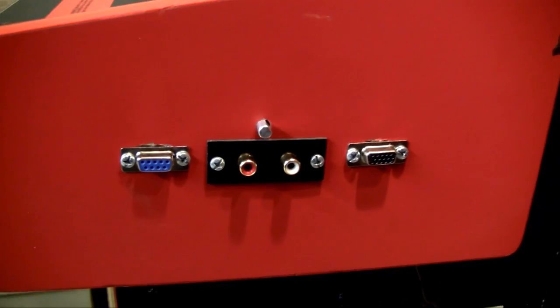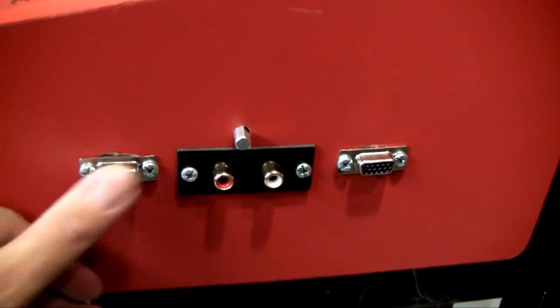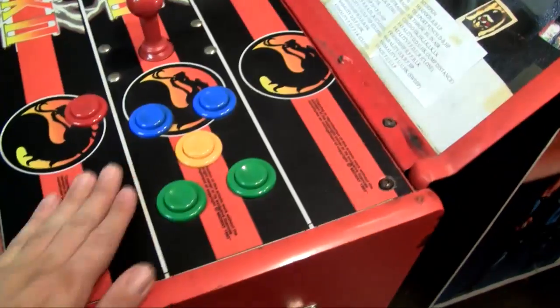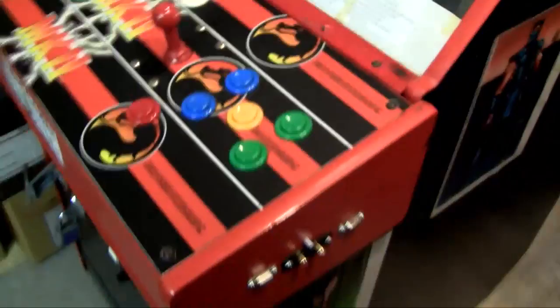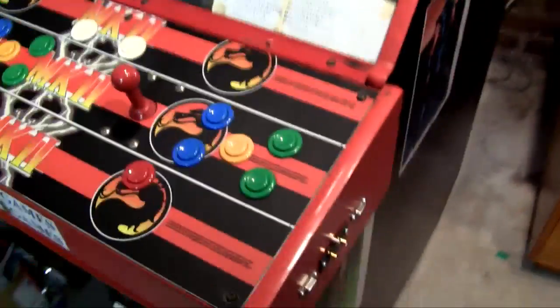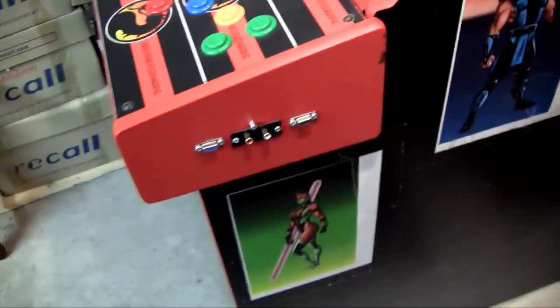And yeah, that was the final look, by the way. I added all these plugs the other day. This audio output with volume control, video output, and this is a serial output for another little circuit board I made. So the board is under this control panel and controls these, and that board had 8 switches on it to control the output picture, the vertical, horizontal and that. So the problem is, if I screw it in here and put it under like I have, you can't get to the board anymore. That was the idea. I just wanted plugs. I wanted it neat. But the problem is you can't get to the 8 switches that adjust the picture.